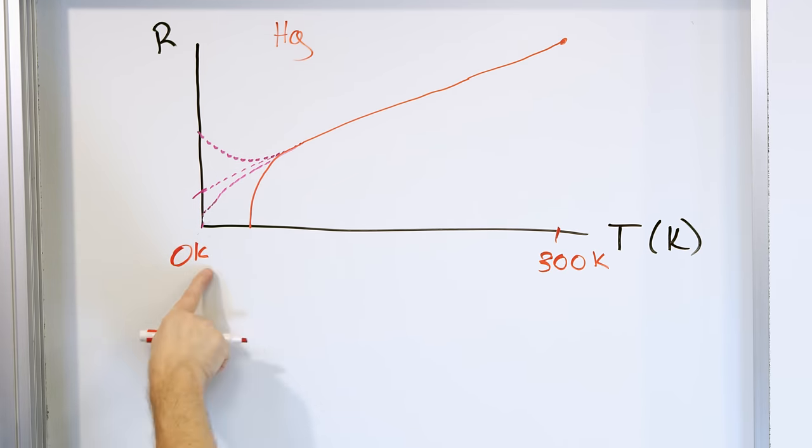They're really manifestations of sort of the same thing, which we call the electromagnetic field. So because of that, magnetism can induce or produce electricity, and electricity, flowing electrons, also produce their own magnetic field, right? So how do we use that? We use it every day in a motor. When you have a motor and you run an electric current through a motor and it spins, what's happening is you're running an electric current, there's a magnet in there, and so there's a force that's exerted, a magnetic force, and so the thing turns.